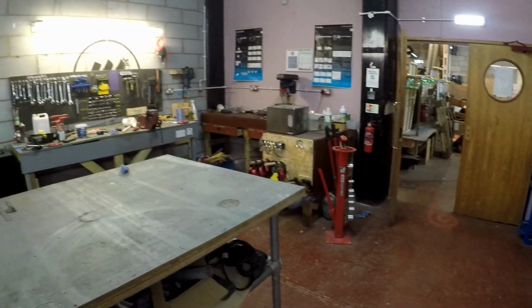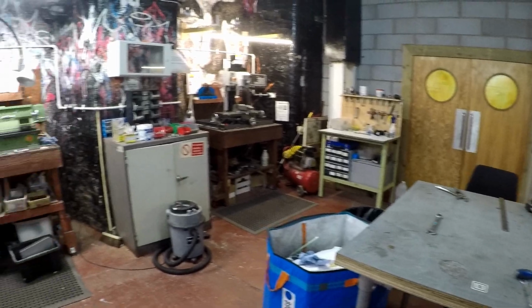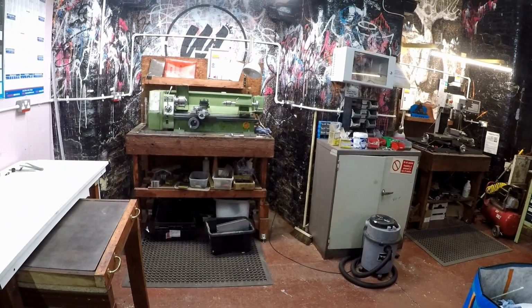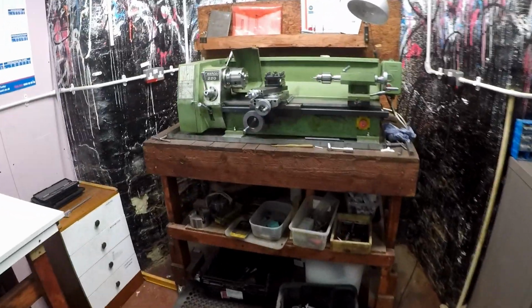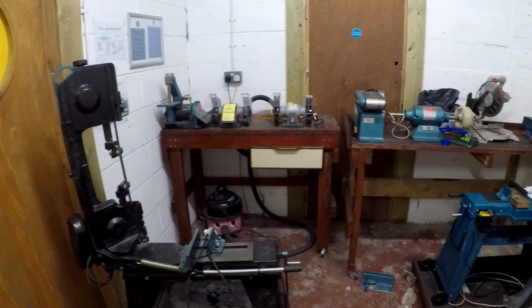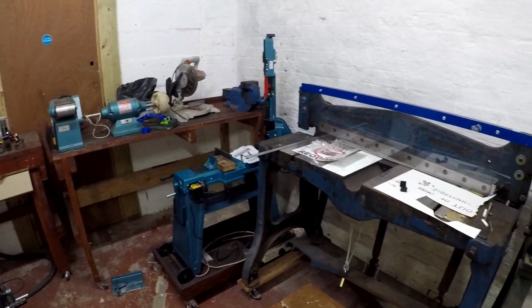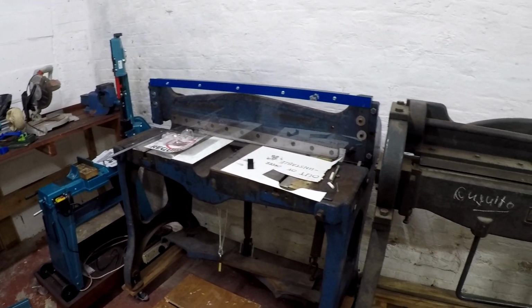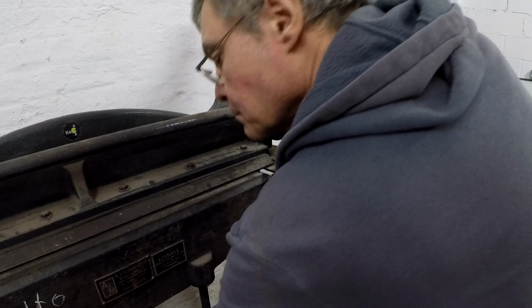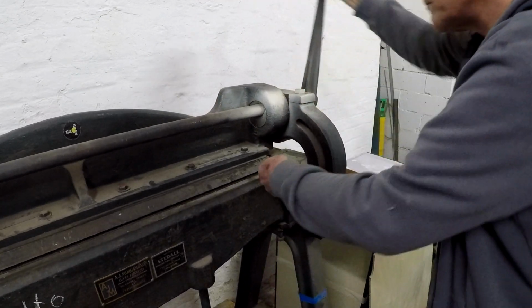The battery's going to be mounted to the TrakTrike frame with some 4mm flat bar that I need to bend in a couple of places to get past the lip caused by the lid. To do this, I went down to my local makerspace, Hackspace Manchester, or Hackman. They've got a pretty good metal working room, and of particular interest to me was the bending machine they've got. It only took a few minutes to bend each one, and I made sure the angles were okay with the rotary protractor.